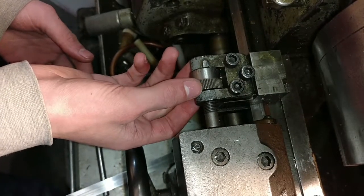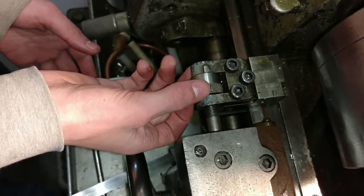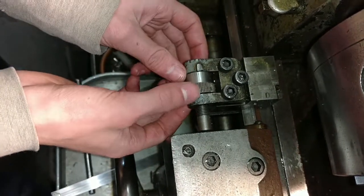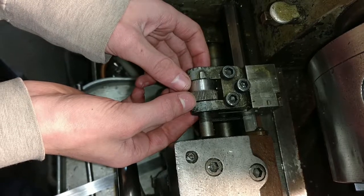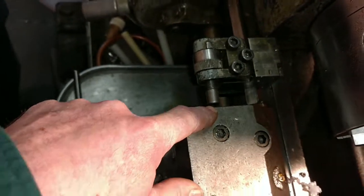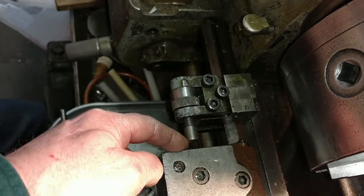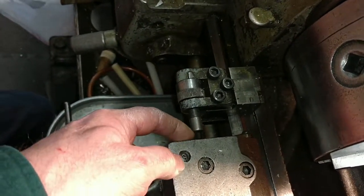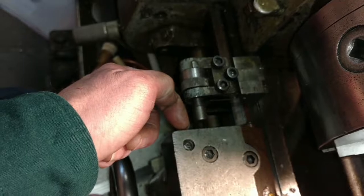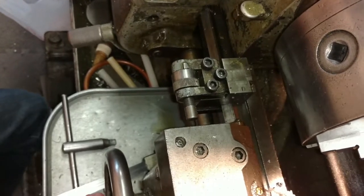Screw that in sixty thousandths. It's labeled. What are the graduations on there? Every twenty, I think? A full turn should be fifty — because it's a half-twenty thread. Oh okay. Then in that case, a full turn plus ten, and then forty. So that should be sixty thousandths right in that gap. There's another way to do that: forget the graduations on here and put a shim in there — either a gauge block or feeler gauges — something you know is correct. And you bring your stop up to the feeler gauge, then remove it and you've got a travel space.